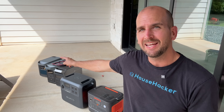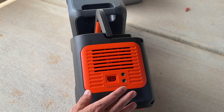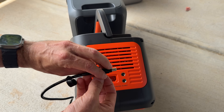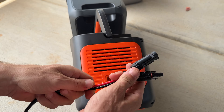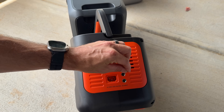Others in this lineup are at 500 watts. Some of the higher-end, more expensive ones are at 1,000 watts, and the Anker Solix C1000, which we're testing for the first time today, can actually do 600 watts. Jackery seems to focus on the beginner or amateur market, giving you a simple plug-and-play design. You're going to need a DC 7909 conversion cable that takes you to MC4 connectors, or if you stay within the Jackery lineup you can just get their solar panels and they plug right in.